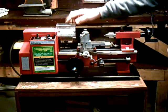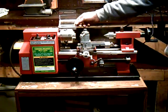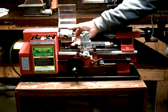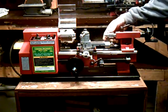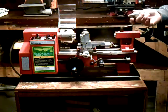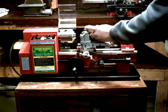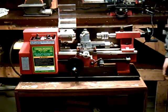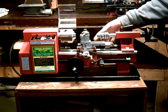The machine comes with a pretty good three-jaw chuck. It's got this plastic cover on it — I've seen some people take it off, but it acts as a safety mechanism; you've got to have it down for it to be in the power position. The three-jaw chuck is pretty good and I don't see any need to upgrade at this point. It comes with a nice live center, pretty good quality. For about $10 you can buy a drill chuck from Harbor Freight that's compatible with this machine, and one of the operations you do a lot on a lathe is drilling, so this drill chuck seems to work pretty well.